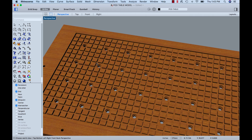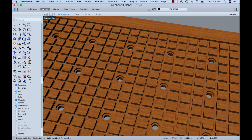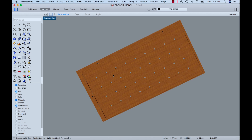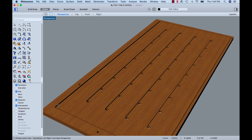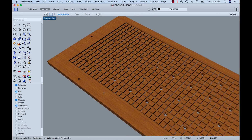The grid you see on the model — these grooves — are a quarter inch wide, 7.5 millimeters deep, and 30 millimeters on center, to make it fit the pods. Within every 120 millimeter square there's a vacuum port that goes underneath, and those ports have plugs in them. If we look at the underside of this, you can see there's some machining on the back that helps distribute vacuum to those ports from the table underneath. I also incorporated a groove for gasket, but it turned out I didn't really need it, so I actually didn't cut that.